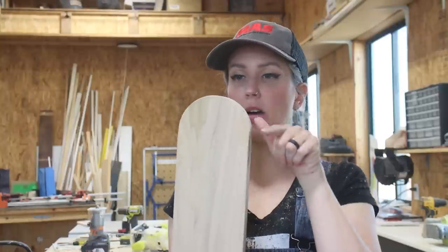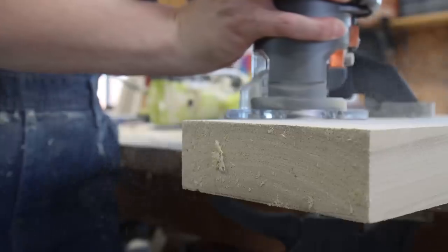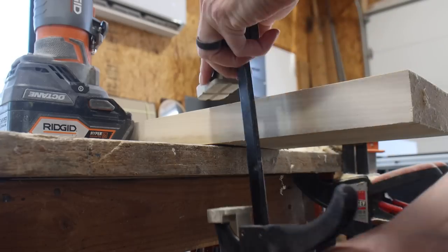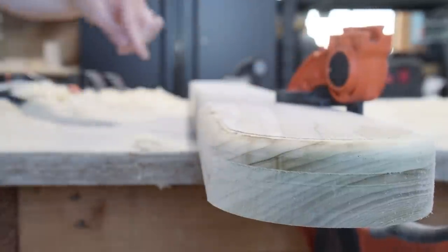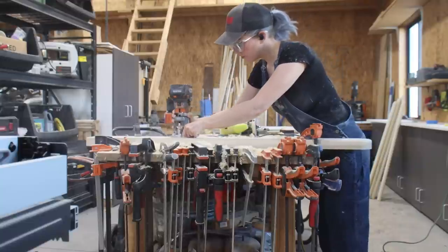All my boards have this lovely full-radius arch cut on them, so now it's time to add the round-overs, which is going to give me a bullnose or double round-over on both sides. In my experience it's not a good idea to try to bite off too much material with a router bit all at once — that can lead to chipping and splintering or even your router getting out of control. I typically recommend taking small passes and nibbling away at the edge before you really hog out all that material. So I'm going to first start by running along the edges of all the boards using a quarter-inch round-over bit on a little trim router with a quarter-inch shank bit, which will just knock off that first little sharp edge.